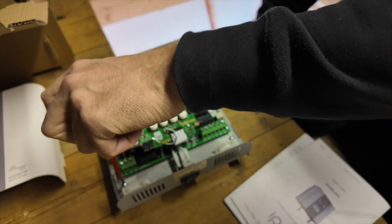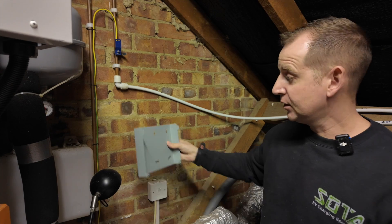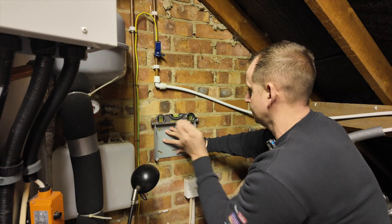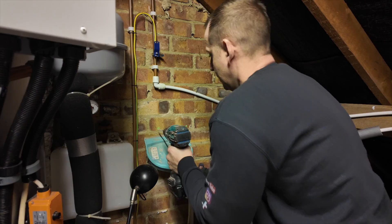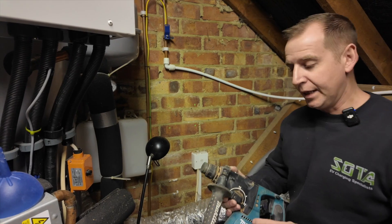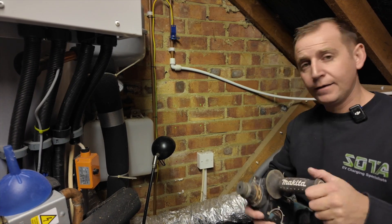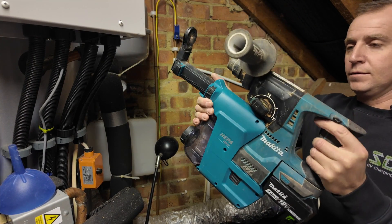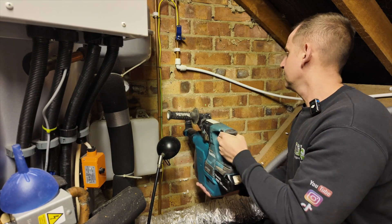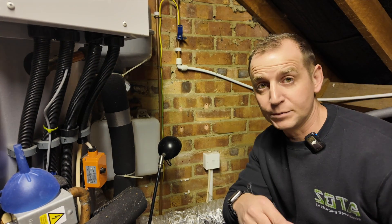There are two screws you must undo to separate the eddy from the mounting bracket. Get the mounting bracket fixed to the wall, make sure it's nice and level, and mark your holes. Today I'm using the chalk marksman — I love these things — and then drill your holes. These bricks were too hard so I needed to get the SDS out. This is the Makita dust collection system, clips straight into the drill — a relatively new toy and so far I love it.